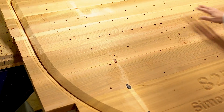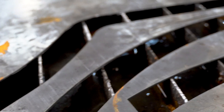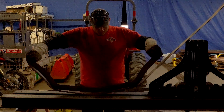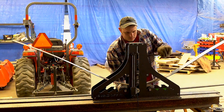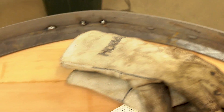At the same time — and probably one of the most important parts — the CNC placed all the holes on the sign blank so that they match up with our stainless steel letters. The only extra step I did was countersink the bolt heads on the back side. Next, we used that same Aspire file to make the steel cutout shape to form the bracket. The bracket is the same shape as the sign, so I cut out a piece of steel that we could wrap the steel band around. That worked out fantastic and really made everything come together.